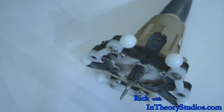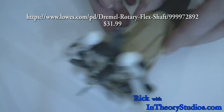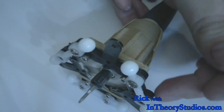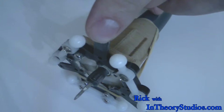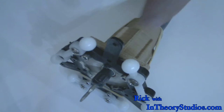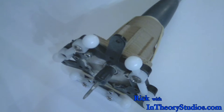This here is the engraver end. This is actually a flex shaft for a Dremel. I just happen to have a Dremel, so I decided to use the flex shaft attachment — I think it was like 30 bucks at Lowe's. I printed this wood model right here. And this black part is the end effector I bought from SeeMeCNC. It's the exact same one that comes with my Rostock Max version 2. I just bought another one so I didn't have to take the extruder and the fans and all that stuff off the existing end effector. I could just keep this one on here and swap them out. These are what you use to plug the arms in — it makes it really easy to swap them out. In fact, I just took this one off and put on my normal 3D printing one. It took less than a minute. Fantastic.